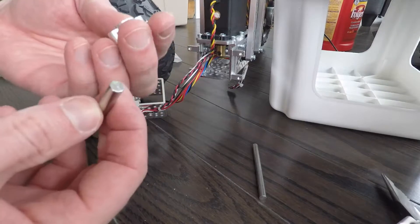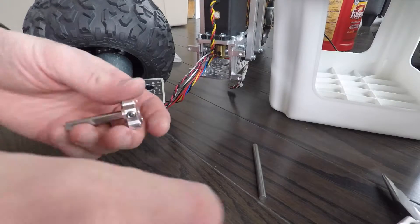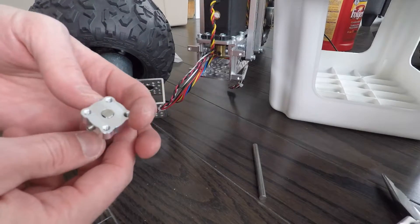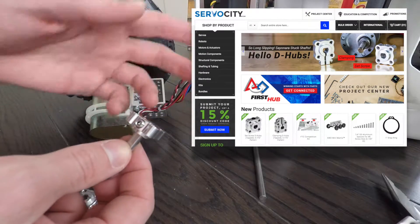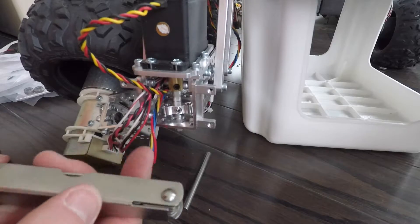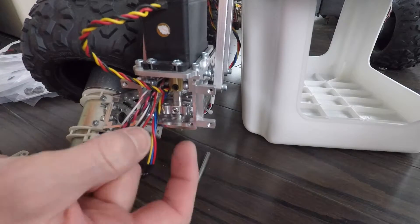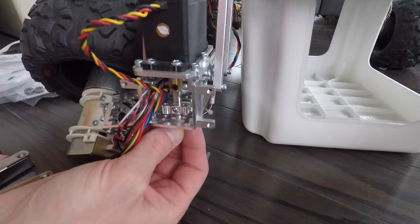I have my doubts about the set screw, but just from playing around with it, it takes quite a bit of force to get this inside even with the set screw completely free. It takes a lot of force to drive this in or to remove it. The tolerances in this design — these are from ServoCity — and I think that might be sufficient: the friction here combined with the friction in the servo shaft might be enough to do the trick. So we've got it mounted now with the set screw hub, and it can rotate. Because of this pushing against the flange bearing, we've got that vertical pull addressed — so the weight of the wheel and motor shouldn't pull the shaft out.